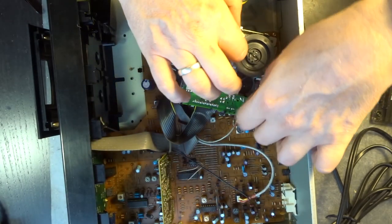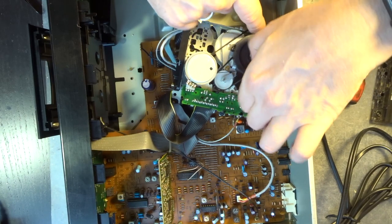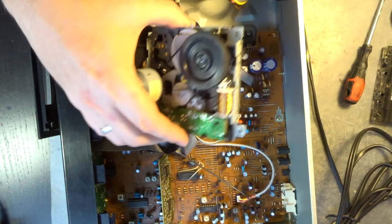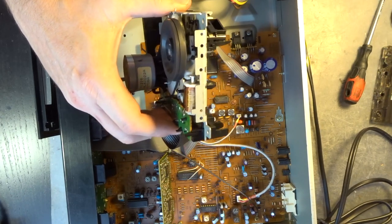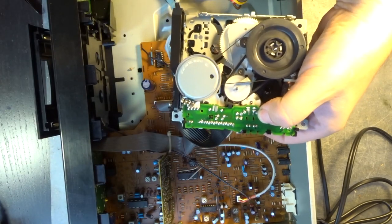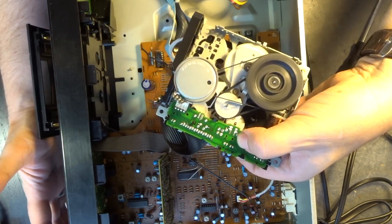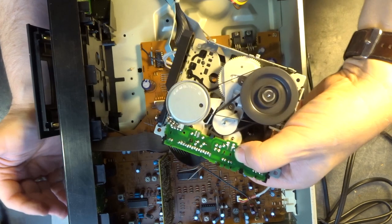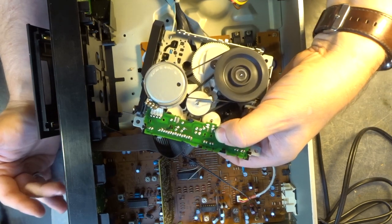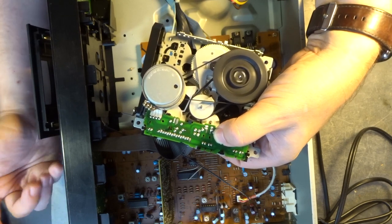Okay. We reinstall the capstan belt. Come on. Okay. So let's plug that back into the power outlet. Britney Spears has to go back inside. And it says power on. Okay. And let's try fast forward again. And it's looking good. How about rewind? Yeah, rewind looks good. Playback works like it did before. So that is great.